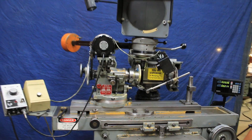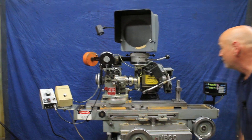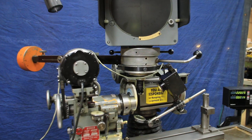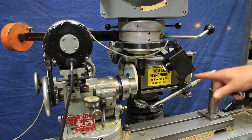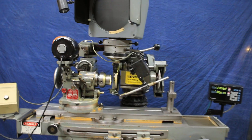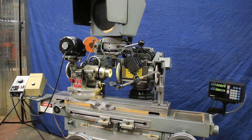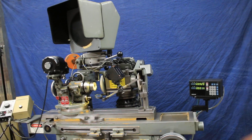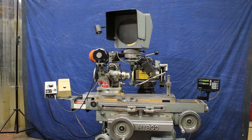I'm going to go ahead and start the grinding wheel. So that's running there now. You've got two wheels — a left wheel and a right wheel. The left wheel has a left-handed thread on it and the right wheel has a right-handed thread. That's why there are two different types of wheel hubs with the machine: left-handed ones that belong on the left side and right-handed ones which belong on the right side.